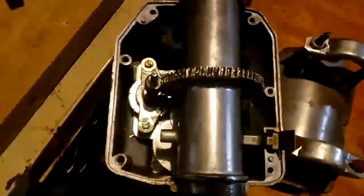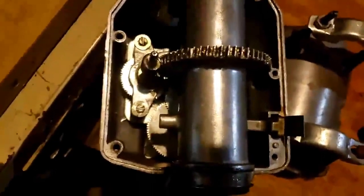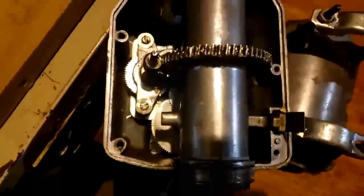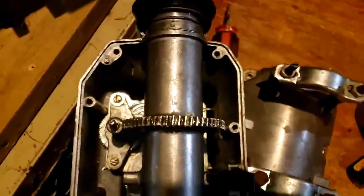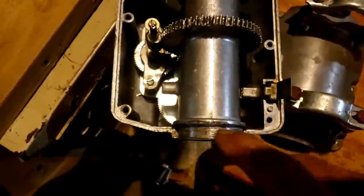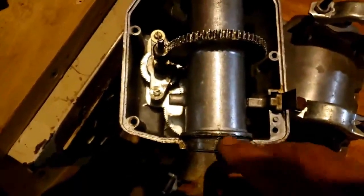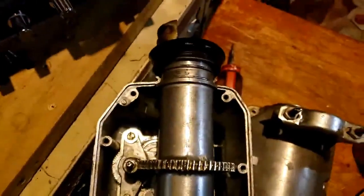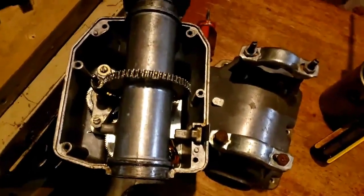I figured while I had the rotor down — this is the one that's going to go on the boom — I would open it up and lubricate everything. I put a nice coat of 30-weight oil on all the moving parts, all the gears, including the ends here. I also oiled those — underneath there's oil on top too — but the surface underneath rides against that. Alright, I'm going to button this thing back up and it'll be ready to go on the boom.